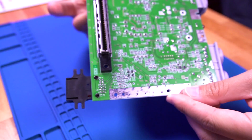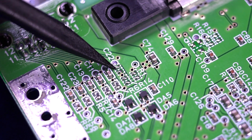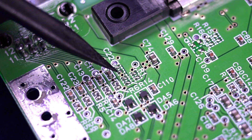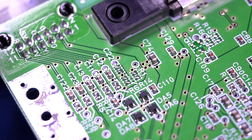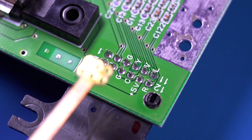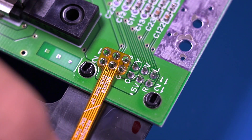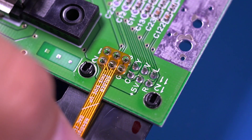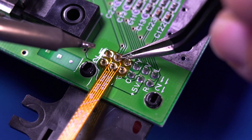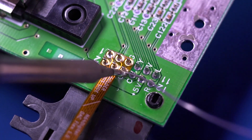On my particular motherboard revision, I was supposed to remove capacitor C22 and resistor R14 according to the official instructions. However, to my surprise, they were already gone. Be sure to consult the official Pixel FX instructions, which has details regarding each board revision. Let's go ahead and solder in the RGB flex cable. Place it onto the pins as shown, making sure the ribbon cable is oriented correctly. Go ahead and apply some flux to the area and tack it in place, then go ahead and solder on the rest of the pins.